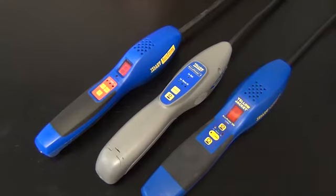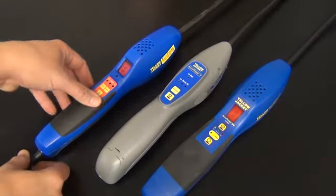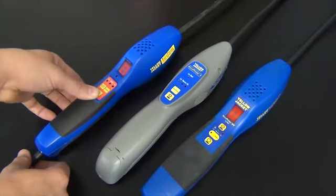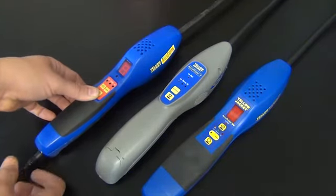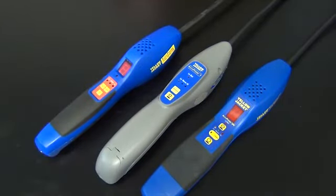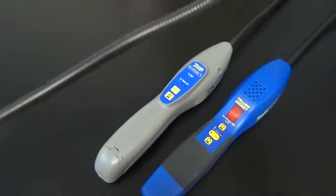If you have the original Acuprobe, you may have experienced this complaint. You try to turn on your leak detector and then try to turn it off, but it will not turn off — you have to remove your batteries to get it to turn off. If the sensor is on incorrectly, not pushed on all the way, or the sensor is bad, the leak detector will not turn off without removing the batteries, and that's just on the original Acuprobe.